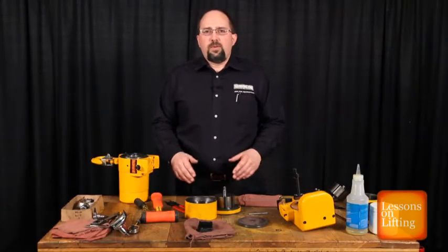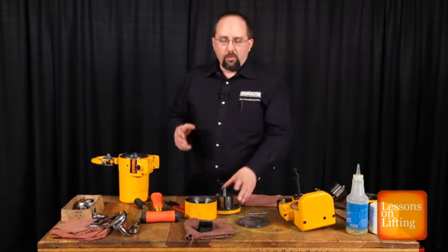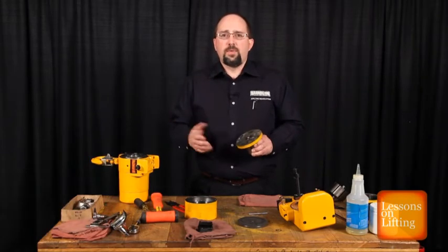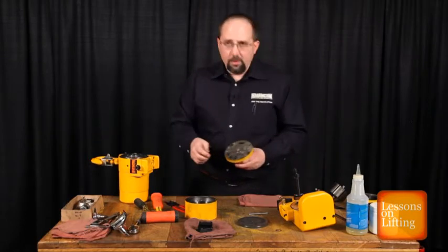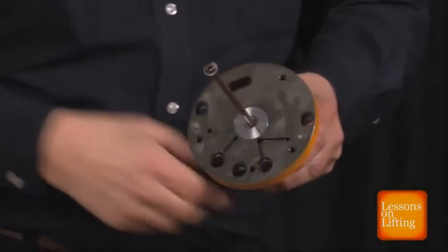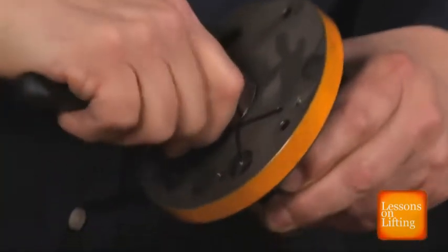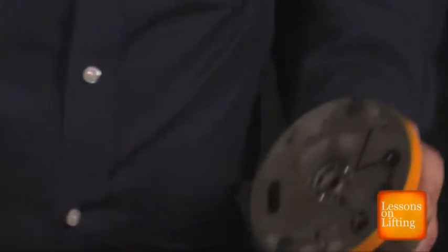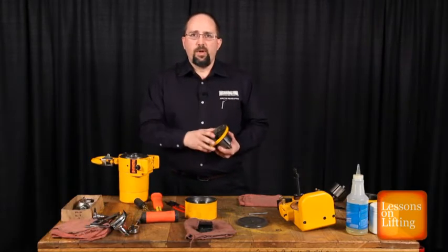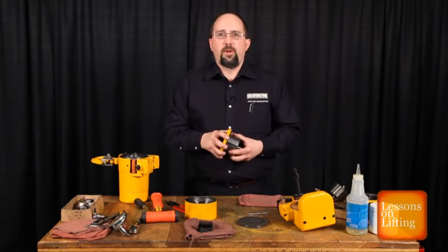The purpose of this lesson is to provide information so you can assemble the air motor correctly. We're going to strip it all the way down, completely take it apart and put it back together so you can see all the steps necessary to do it properly. First, we have to remove the rear bearing retainer — this is where we took the brake tube out of earlier. The brake tube sits down in there like that. It only has an O-ring that holds it in. Be very careful — it is soft aluminum. Use a little pick, get underneath it and work it around. Now we have the rear bearing retainer out. We'll take this assembly to the press, press the rotor out, use a puller to pull the rear bearing out, then put it all back together properly.